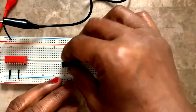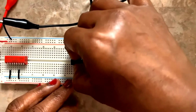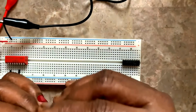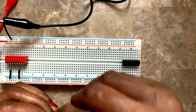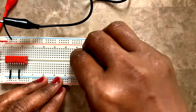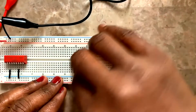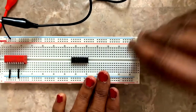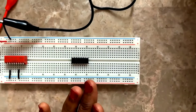Okay, I'm confident. So see the place where I'm fixing on the breadboard. It doesn't go, as I said. You have to adjust it to exactly 90 degrees. You press a bit, that's it. And fix it a little farther from the dip switch. The reason is this is 7432. I'm keeping 7432.